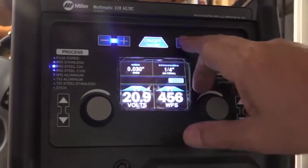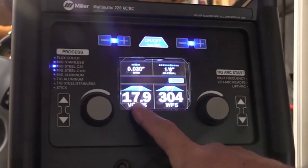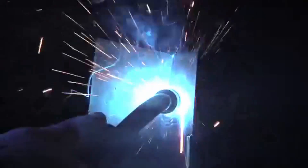For vertical uphill, instead of turning the auto set off, I'm just dropping down to the settings for 1/8" — 17.7 volts. I actually tweaked it up 0.2 volts; I found that worked a little bit better, but 17.7 worked pretty good too. The technique I'm going to use is a series of triangles, kind of tracing the front of the puddle. It's a teardrop shape that keeps the wire at the leading edge of the puddle — that's where the business end is, that's where you get your penetration. If you hang back too far in the puddle you have problems with short circuit MIG. A nice short stick out will always help.